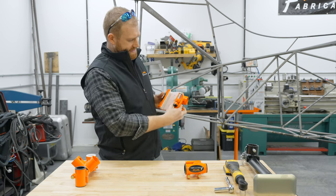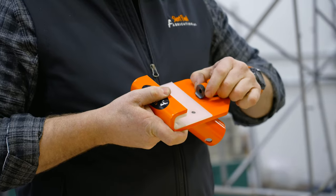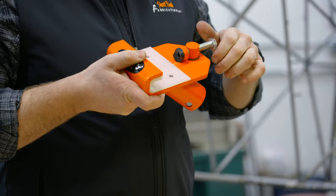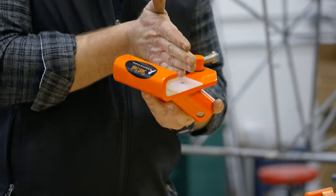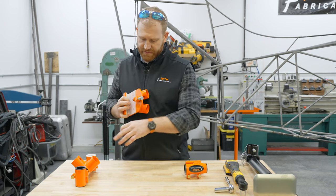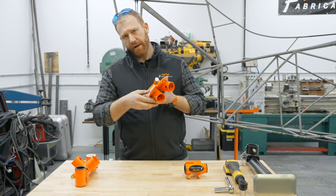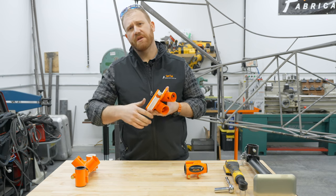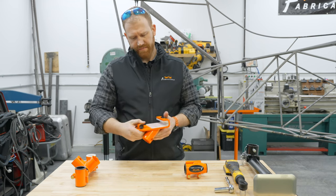It simply goes from back to front — it snaps on. Then you pivot this bolt into place, and on the front of this, the head pivots and it's got a little machined cup, again to protect the coatings. You just tension this bolt up, and because the gear has a slight angle in it, this pivot accounts for that angle. It sandwiches in place, and then, just like the Cub jack, it locates a tube. Slide the jack on, pin it in place, pick the airplane up. As it's picked up, it will try to tension itself, so you don't have to get it super tight. To remove, just undo it and it comes off the airplane super quick.